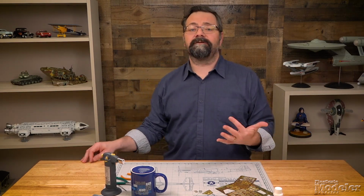I'm Tim Kidwell, and we're going to talk about annealing photo-etched metal. Now, annealing is not the same thing as tempering. Tempering, you're using heat and quenching to make a metal harder, stiffer. What we're going to be doing with annealing is making the photo-etched metal more malleable, easier to bend. Now, you may ask, why do we want to do that?